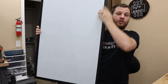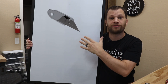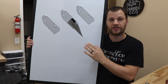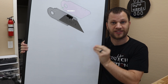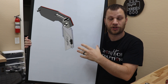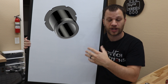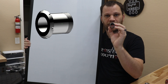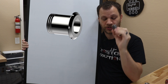Let's head over to the neighborhood of make-believe so I can talk about the 3D model. The DiResta razor blade slides into that front holder part. I'm going to sandwich the razor blade between three pieces, with the center part being hollow so the blade can slide in and the outer two pieces sandwich it together. The front holder piece is connected to the back half using a pin, so I need to find a large scale tube that's threaded on each end. I went to the hardware store and picked up a piece of black pipe that's threaded, but it's tapered so I'm not sure if it's going to work.